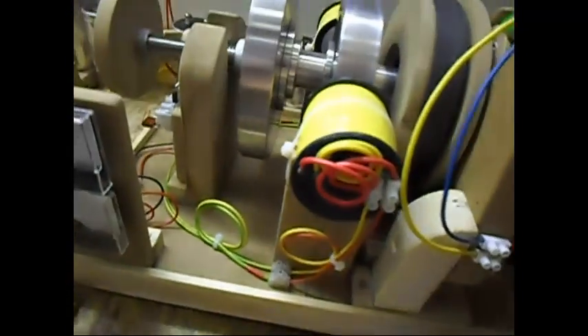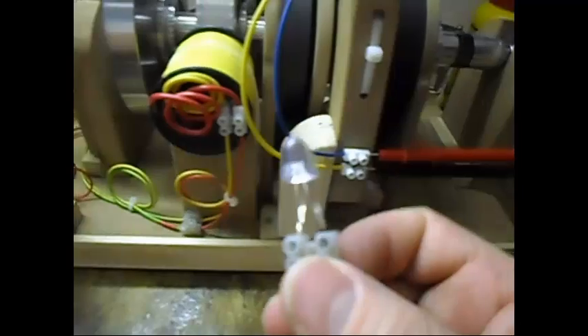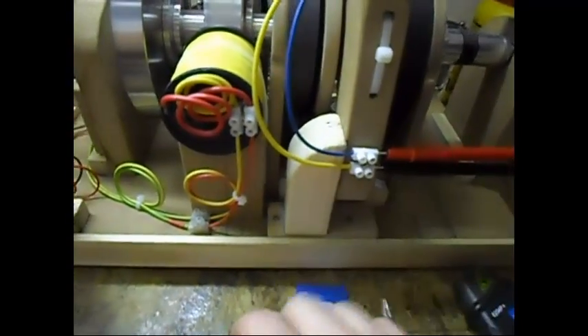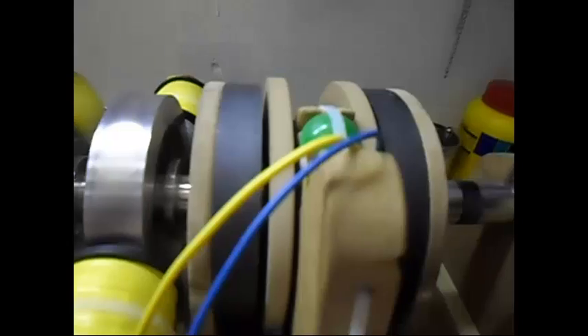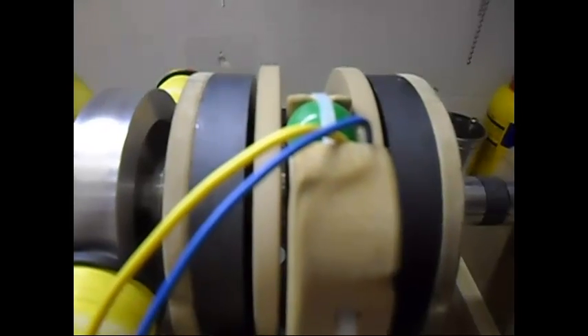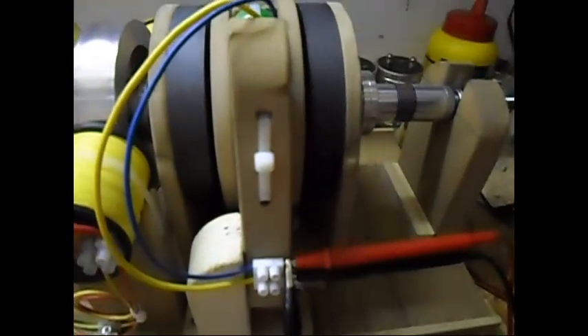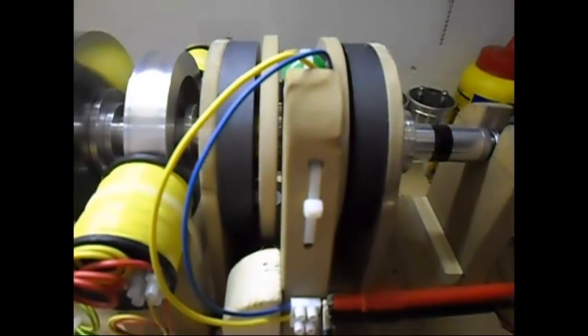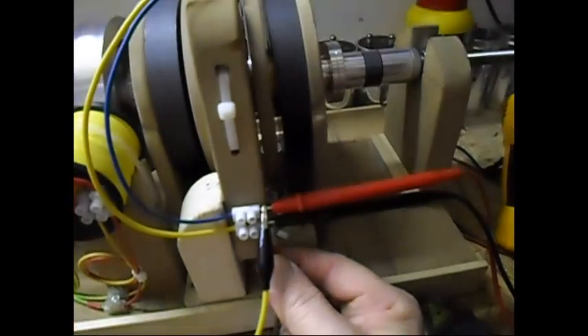Now I'm going to do a load test. I have two LEDs, because if I use only one it will burn it out immediately — I already wasted three of them yesterday. It is the same coil as before. But now, since the magnets are in pull mode or attraction mode, the output seems better. Because the coil is the same, the core is the same, everything is the same. And this time the speed is even lower, because last time I did that with the same coil I was running through the voltage doubler.